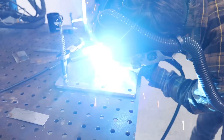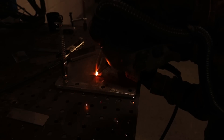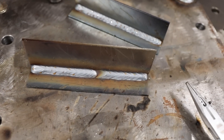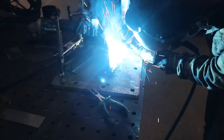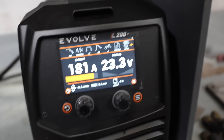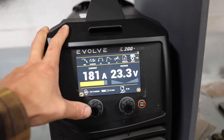So let's crank this up. That was 3mm — I trimmed the voltage back a little bit about halfway through just because it seemed a little too much. I cranked the machine all the way out to its highest synergic settings and it actually tripped the breaker, so I had to come down a bit. That was what it was recommending for 3.3mm at 23.3 volts — definitely hotter than what I'd probably be welding 3mm on, but I just wanted to see what the pulse is like now.